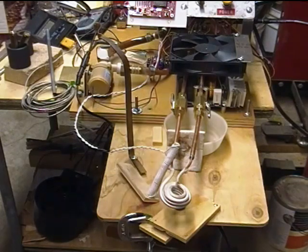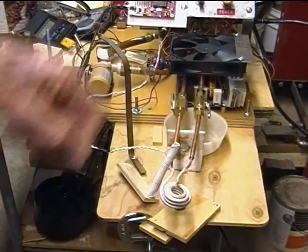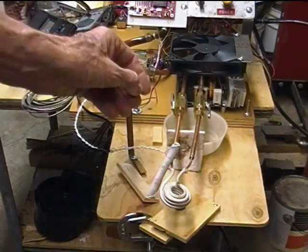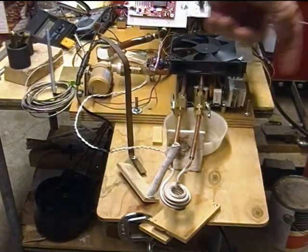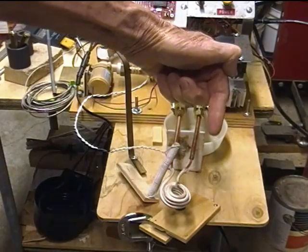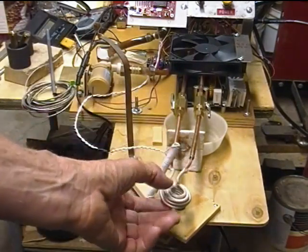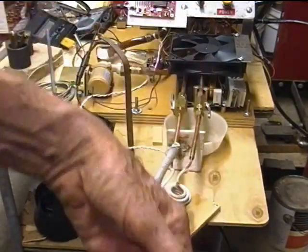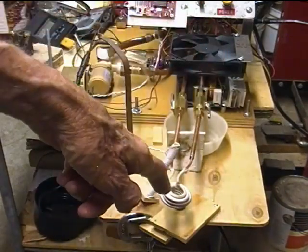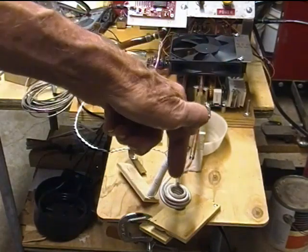One of the other things that made me realize I'd get a lot more blast with this fan is that it draws about three times as much current — marked here at 450mA at 12 volts compared to the first fan. Also worth noting: when that fan blows, air comes right at the work coil, and a person should be blocking that blast from actually getting to the work coil. Not so much for what it's going to do to the coil itself, but for the work — if you're trying to heat up something fairly large, that amount of moving air can take away a lot of the BTUs you're trying to keep right there. So I put a little piece of insulation here to keep that direct blast away from the coil.